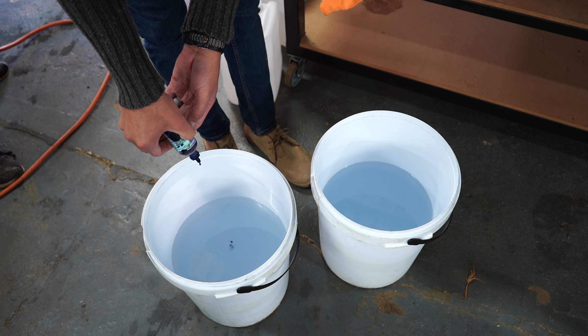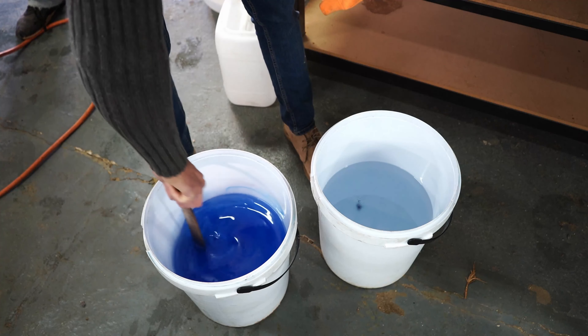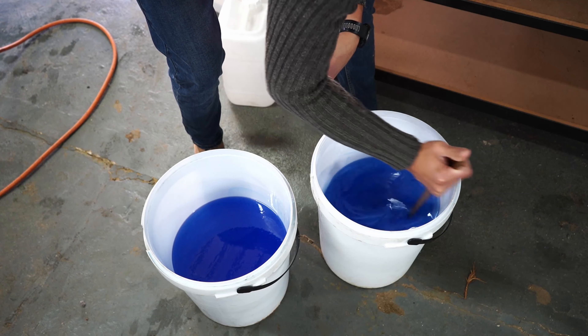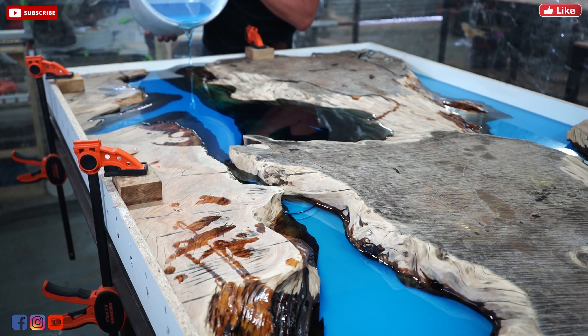It's winter now so it will take around six days because epoxy takes longer to cure. A massive tip for casting the next layer: the layer I'm tapping now is tacky — like a toffee — but not yet in liquid form. This is absolutely the best method we found. Instead of waiting for that layer to fully dry, sanding it, then casting the next layer, wait for the perfect timing once the layer becomes tacky, then cast your next layer. That bond between the two layers is absolutely the best you will ever get.